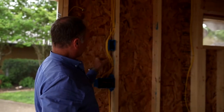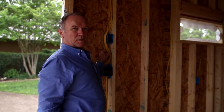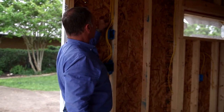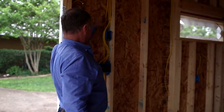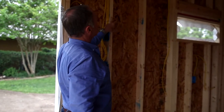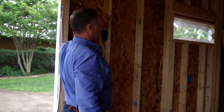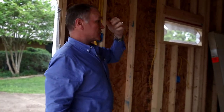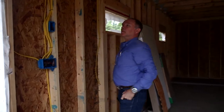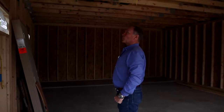This is close, but since we're going to do our own, I'm not going to worry about this — this is not sheetrock. What happens is sometimes people think we're not going to get sheetrocked, it's a garage, but you can't count on that. So you move these over and make sure they're out of the range of a nail penetrating. But since we're doing this with our own guys on the inside, we'll make sure to mark them. And we're putting OSB plywood on the inside.